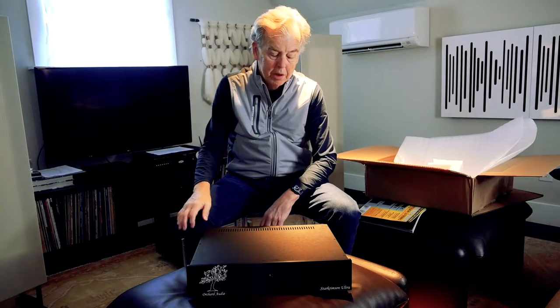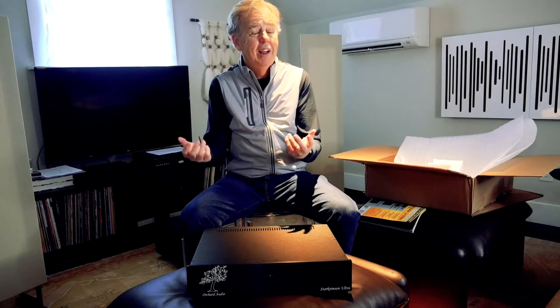Your typical home wall outlet is on a circuit with a 15 amp breaker. In the United States, 120 volts times 15 amps is 1,800 total watts. Only having a power amplifier that requires 1,250 watts means we can run this off a normal household circuit and still have extra power for the other items that are bound to be part of our system — sources, a server or CD drive, a D-to-A converter, switches for your network, and frankly lights. At the end of the day I like to have a little bit of headroom to be sure I can produce the full power of the amplifier.